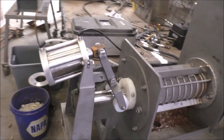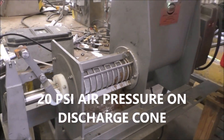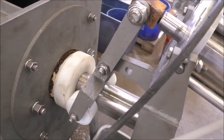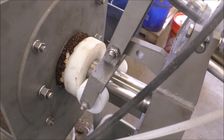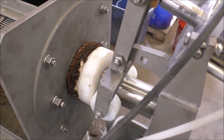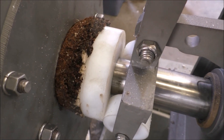We've got the cone shut with 20 psi air pressure on the discharge cone. The press is filling up. The white stuff is desiccated coconut left over from an earlier trial. You can see the wet cake is the dark brown, and the drier stuff that's been squeezed a bit is the light brown.